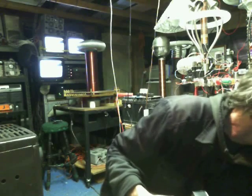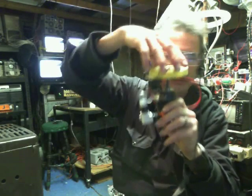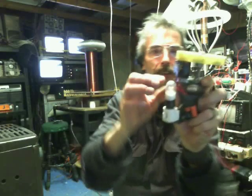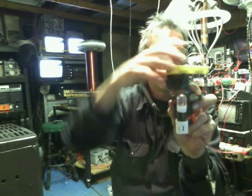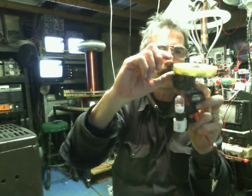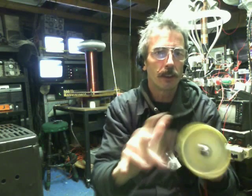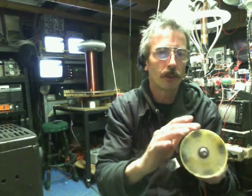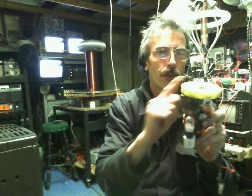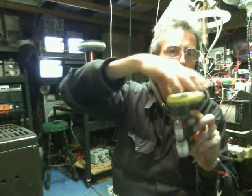For example, I've got this one right here — this little mini generator that I made — and of course it's kind of messed up right at the moment. Either way, you can see there's a gap in between there. I can actually reduce that gap or bring that gap farther away and still be within the field and have less drag on my flywheel. So you'll still get the magnetic pulse that you need to pulse your coil. Obviously, the closer you are to your coil, the stronger the field is going to be when it pulses out, but you'll still get energy without having to have so much force behind it.